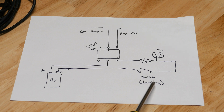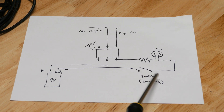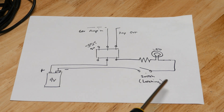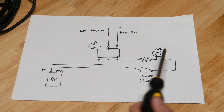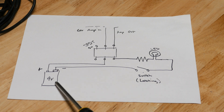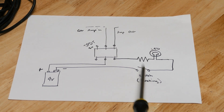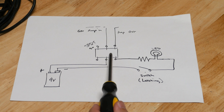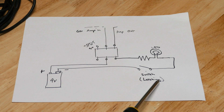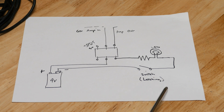We're going to run into the same side of that switch so that when this circuit is active we light up and engage the LED. I'm also going to install another latching switch in line with this circuit on the negative side — it's best practice to throw switches on the negative side. I don't want the foot switch to jostle around and accidentally leave the LED on for a week. At a couple milliamps draw, a nine volt will last a long time, but the extra switch means we have to deliberately turn it on.